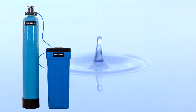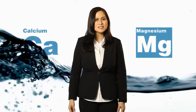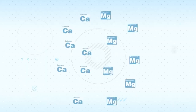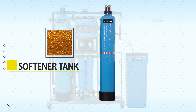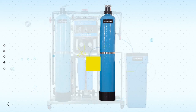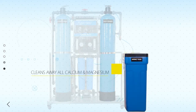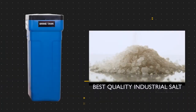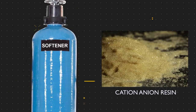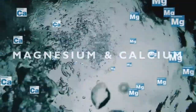our Blue Waters Unisystems also comes with a water softener and a brine tank. Most waters have calcium and magnesium that make it unpleasant and heavy to drink. The Blue Waters Unisystems takes away these elements through the softener tank with cation-anion resin to create soft and drinkable water. The brine tank helps to regenerate the softener by cleaning away all calcium and magnesium. Like the best-quality industrial salt that we use in our brine tank, this salt effectively makes the cation-anion resin life last longer because it will flush out all the magnesium and calcium through the regeneration process.